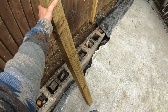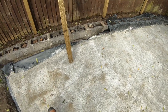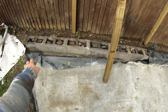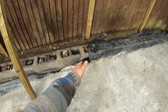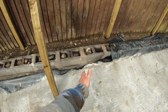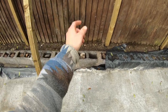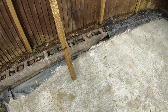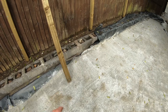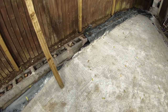I'm going to be using these 75mm square fence posts. Basically there's going to be one at 120cm intervals, and in between, so halfway at 60cm, there will be a slightly thinner upright as well — sort of standard wall spacing — and that should make it easier when I board out the inside, because the standard sheets should fit fairly easily.